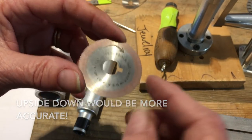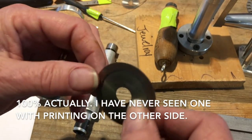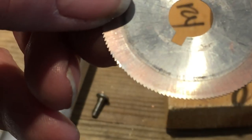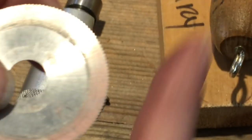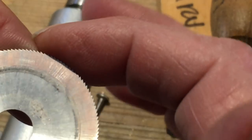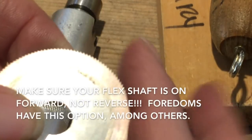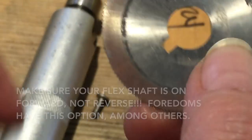With Pepe Tools blades, at least 90% of the ones I've seen, the printing is on the wrong side. So if you're seeing printing on the top, you've got it upside down. The big indicator — I'm going to zoom in — is that you want the teeth pointing that way. This thing will be spinning counter-clockwise, and the teeth need to be sharp when you drag towards yourself. This catches, this doesn't. So make the teeth go away from you so it spins counter-clockwise.